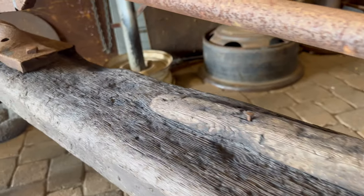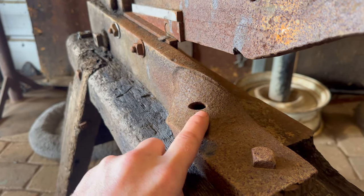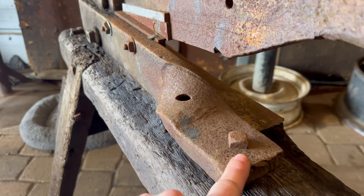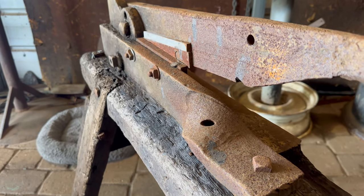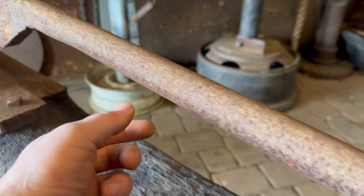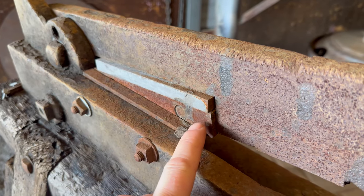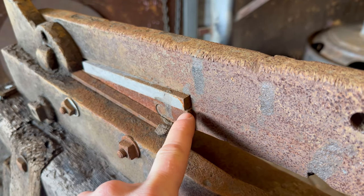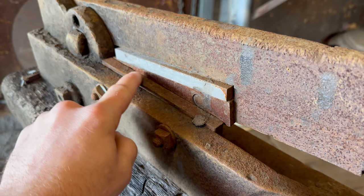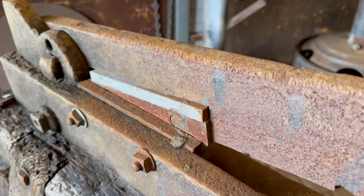It's so neat to be able to follow their train of thought. They probably originally thought they were gonna get two holes down on this thing, but this curve cost a little bit too much material. So they got one out and it apparently worked just fine for them. You can see a little bit of a weld here where they joined a 1¼-inch bar. Now here they were being awfully clever. They made it to where they could replace, sharpen, and maintain that hardened steel bit surface where the rubber meets the road. And everything else is probably mild steel.